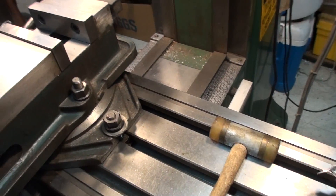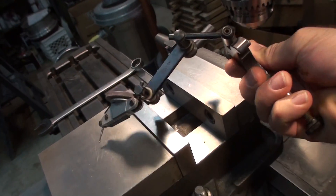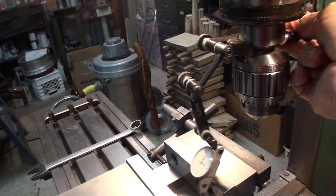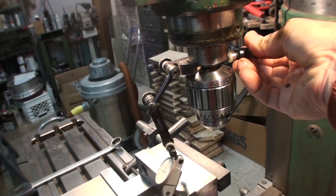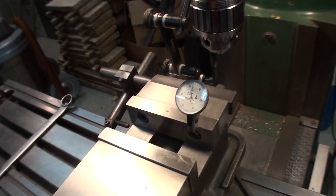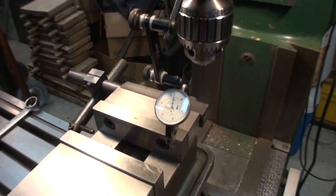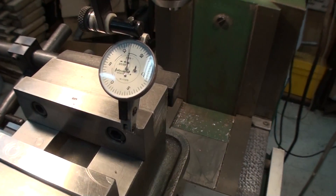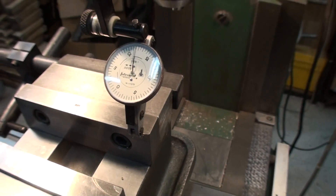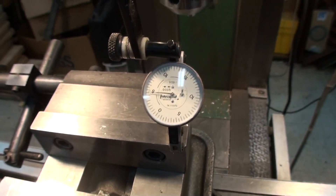Pick your favorite indicator. I like to use an Interrapid on one of these Indicol mounts — they're pretty handy, mounted on your mill. If you don't have one of the mounts, you can just put the indicator in your drill chuck or in a collet, however you want to do it. Line the indicator up with the right end of the vise jaw and bring the table out until you just start to see the needle move. It doesn't have to be set on zero or any number in particular — all you're doing when you indicate the vise jaw is looking for relative movement.